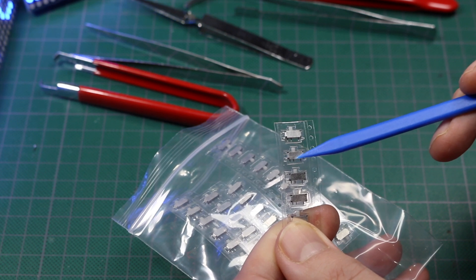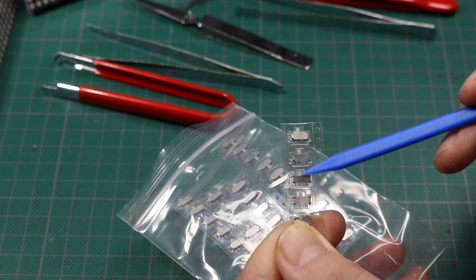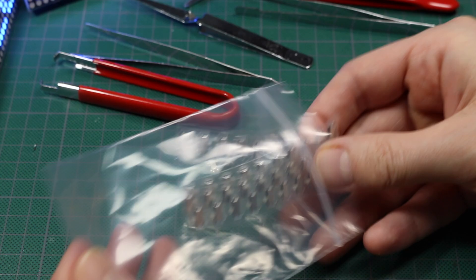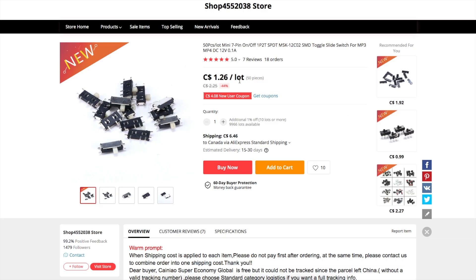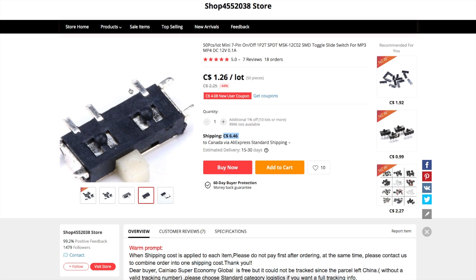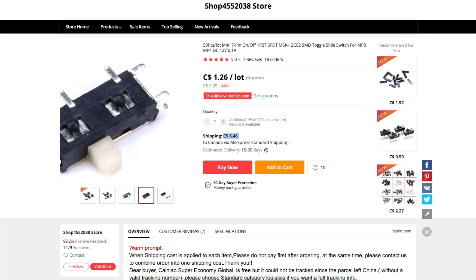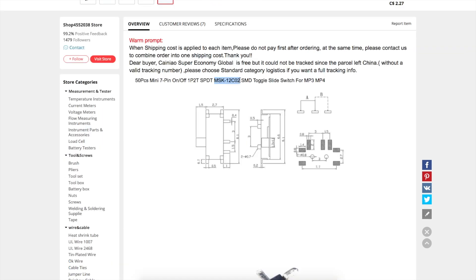The one on that other PCB I only had one of — I actually took it off a different PCB. Then I realized I can get these easily on AliExpress and there's already a footprint in KiCad, so it seemed like the right part to get for a tiny switch. 50 pieces of this little slide switch — the part number is MSK-12C02. You can get 50 of these for just over a dollar, but you're going to want to find better shipping. These are really tiny surface mount parts with four pins on the sides for mechanical mounting and three terminals. Having the part number, we can look it up ourselves.